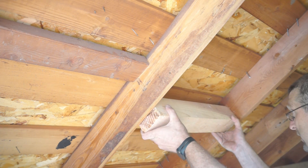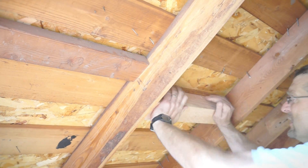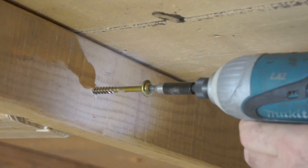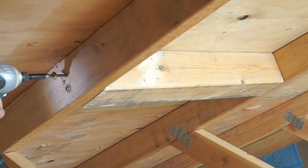With your blocks cut, insert the wood block into the desired location and if you've already drilled the hole through the roof, carefully center that wood block under the hole you've drilled. Secure the block by either screwing two lag screws into each side, or you can nail it if you have enough room to swing a hammer. That's all there is to it — if you have attic access, wood blocking can be the easy solution to roof mount positioning problems.